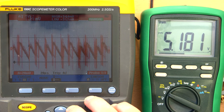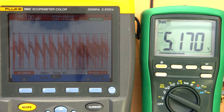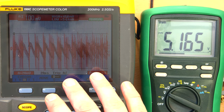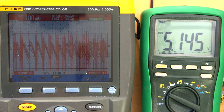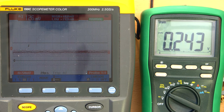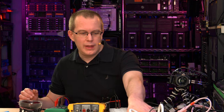At 2 amps the noise is steadily getting worse — about 100 millivolts peak-to-peak, which is starting to get a bit silly. At 2.5 amps we're holding steady voltage-wise and noise is getting a little worse, with the frequency changing around even though the load should be constant. At 3 amps I'm actually surprised it's holding out — noise is getting crazy, about 125 millivolts peak-to-peak. When I tried to go slightly over 3 amps it cut out, so it's capable of 3 amps — more than adequate. Pleasantly surprised.